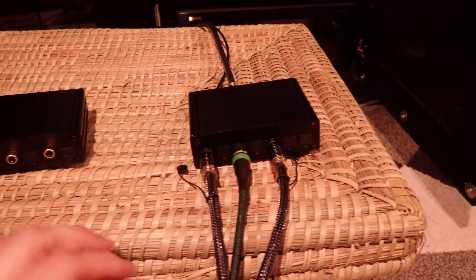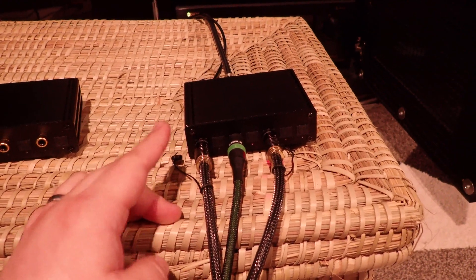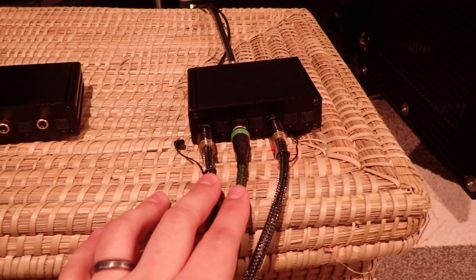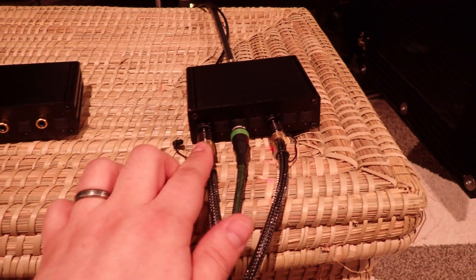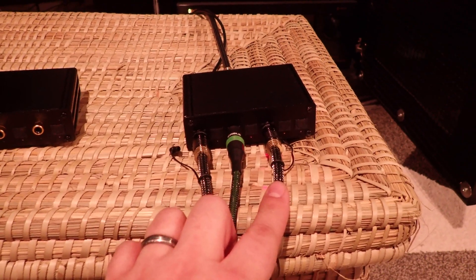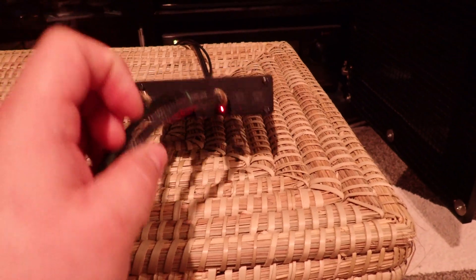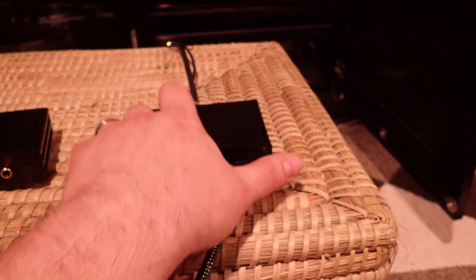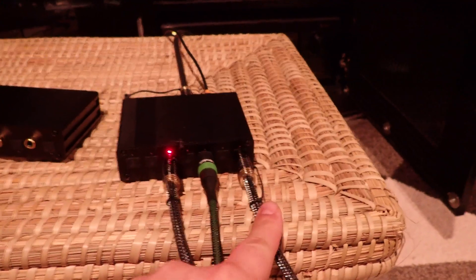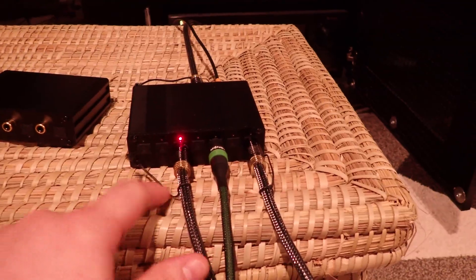As I mentioned, these are fully automatic switches, so whichever input is active will be automatically routed to all the outputs. But if there are two inputs that are active, it has a priority system where lower numbered ports, like number one on the left, will be favored over higher numbered ports. I have to mention that the status lights are on the bottom, so when I'm showing how this works, I'm going to flip this unit over — so just for this video, the port on the right is going to have priority over the ones on the left. But in normal use, you can ignore that.